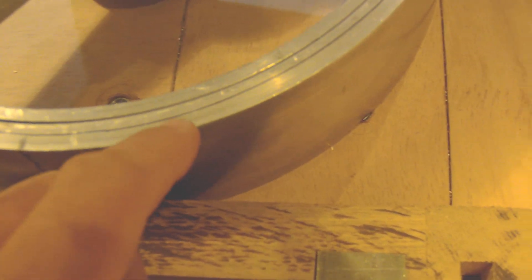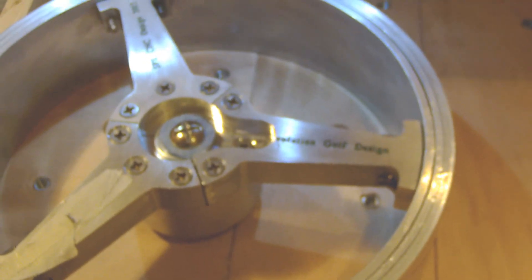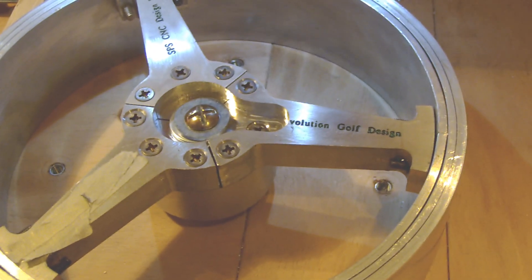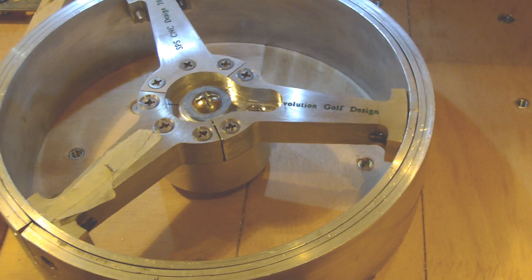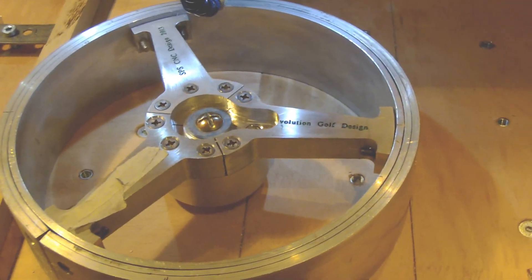I make a line where the groove should be. The center of the wheel is not necessarily the center of the wheel, so I made some fine tuning to adjust the X and Y to be sure that the groove is okay.